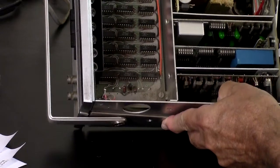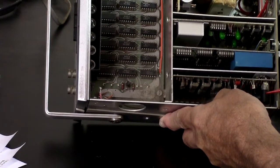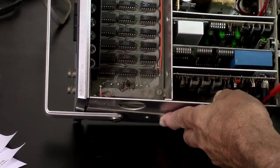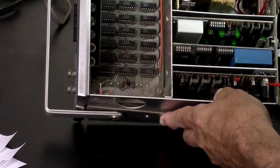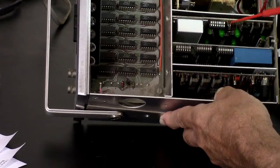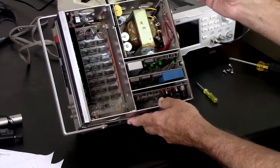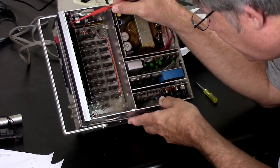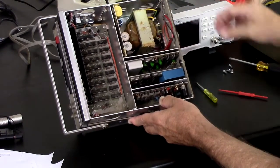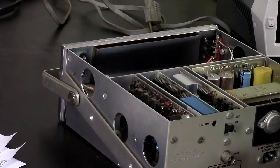What I see here: this is the oscillator board and this is the oscillator. This is the input board, I believe, because it's got a cable coming from the front panel plugging in here via RCA connectors. That would make this the frequency multiplier board, the power supply board's there, and this is the display driver. The bulbs are right there — the little tiny grain-of-wheat things. I may just want to put LEDs in there — should be easy enough to do.